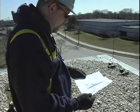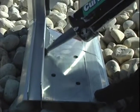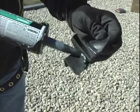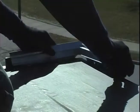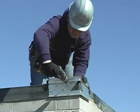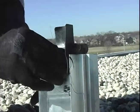Install the pre-manufactured miters first. Apply a heavy 3/8 inch bead of non-curing sealant to the right angle intersection of the deck flange, the back of the anchor bar, and the provided EPDM anchor bar splice plates. Fold the membrane at the corners. Fasten the welded miter bar to the nailer using the provided stainless steel fasteners and driver bit. Place one splice plate under each end of the miter bar.